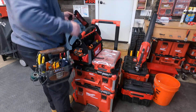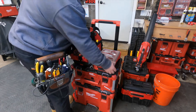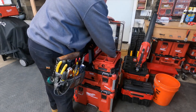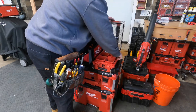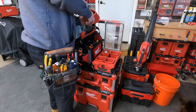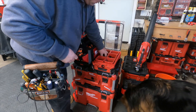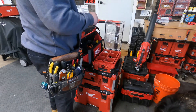Next I'm gonna put on my tool pouch and get the necessary materials and tools that I'll need for this job. This is a rather simple job, but I'm gonna need to find a ground screw, and I'm gonna have to get a four-inch square box, a blank plate, and a couple of screws. I'll use the M12 surge impact driver to drive the screws into the underside of the truss.